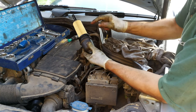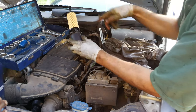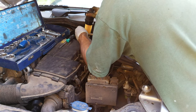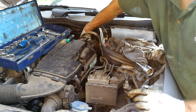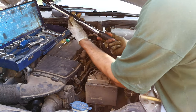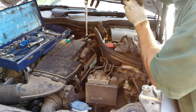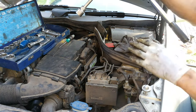Now it's up to you — I like to put some new oil just to drip around this O-ring. So this is brand new oil and I just put a drip around there, just a tiny bit. Now when I put it in, don't get any dirt on these rubber seals — it's very easy to get dirt here because everything is sandy. I'm going to guide it in. Now I'm just tightening it by hand. The lid says 24 Newton meters, so I'm going to set the torque wrench to 25 and use it to tighten this. If you don't have a torque wrench, it's fine — it's basically hand tight, not even a quarter of a turn, almost a sixteenth of a turn. Don't over-tighten it — the rubber seal stops the oil from coming out.